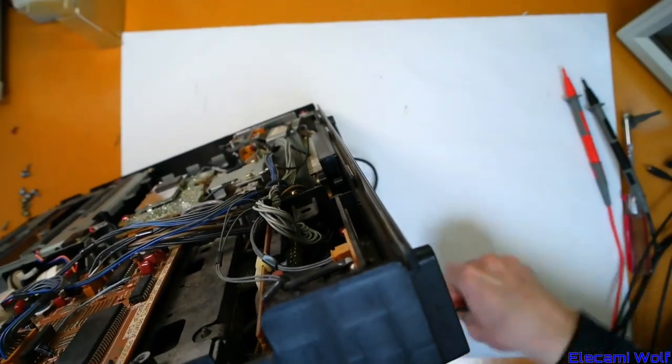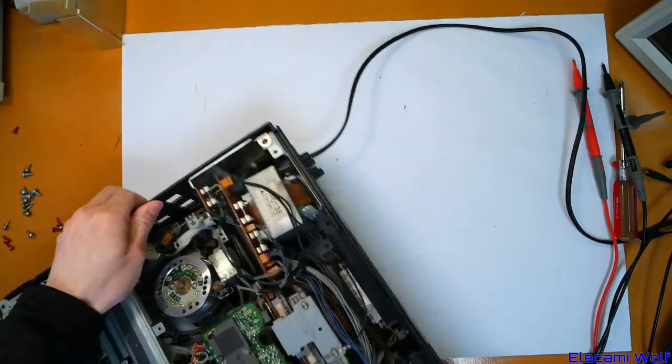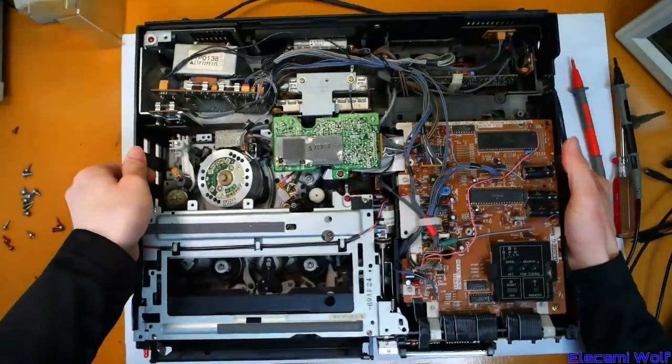Pretty sure the system control stuff is working fine. And that really what we need to be looking at is the timer operations circuit, which should have been pretty obvious — because when the VCR is plugged in the clock does not flash, and that is quite a fundamental thing that should have prompted where we need to look. So we'll start looking at the timer circuit and check the power supplies, crystals, and resets to see what that tells us.